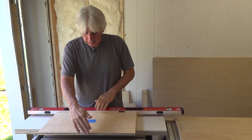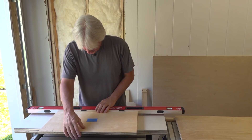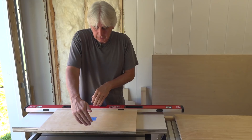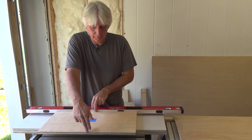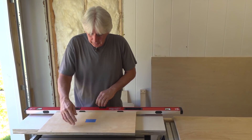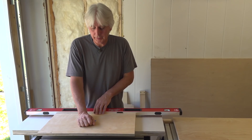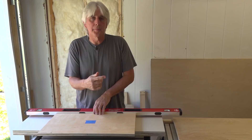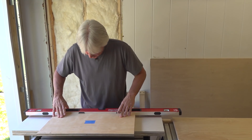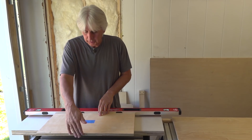The first thing we do is we pick a board up and cut the longer dimensions first, then the shorter dimensions. We pull a level over and check the edge — did we do a good job cutting this, or is the factory edge good enough? We rip this out of the four-by-eight sheet of plywood at about 12 inches wide. Then we come back and rip a little off one edge at around 11 and a half or 11 and three-quarters, and then we go to the other edge on all of them and rip to that final 11 and a quarter. By that time you should have some good parallel edges. We check each one before we cut them, and both sides are really good on this one.